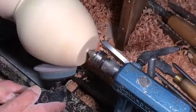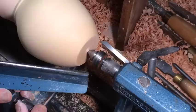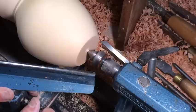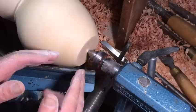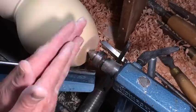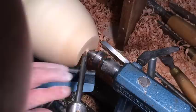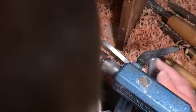So before, this does not get sanded now. That happens later. Now, to get away that last little bit, I can either do it off the lathe. Well, there has to be a little bit of sanding off the lathe. But this is cross grain, so if I just give the tool a little shove, just as the lathe is slowing down, the grain will just shift and break. Mistimed it. Mistimed it again. That's very irritating. That's almost long grain.